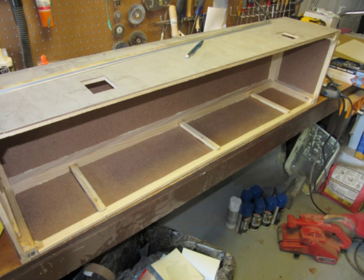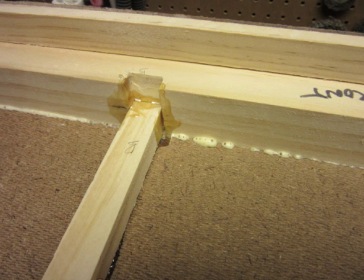sticks like I've got here. And I usually just mill out a bit of the rail and put a tenon on the end of the sticks and epoxy those in with the tenons going into the cutouts. Once again, so that the stress of the weight of the lid when it's tipped back is not going to try to bow the masonite. The stress is taken up by the wooden stick and transferred to the frame.